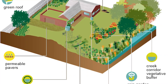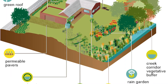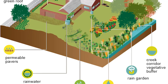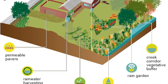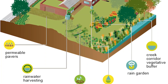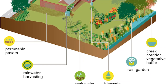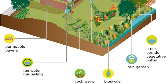Basically you're directing water flow across your property. If you're handling driveway runoff, you'll run rock along the driveway to move that water. Depending on the quantity and velocity of water, you may want to incorporate erosion control blankets to stabilize everything until plants can take over. The last element is your overflow spillway — and when designing it, try not to drain directly onto your neighbor's yard. Best to have a lawn buffer so any washed-out mulch stays in your yard.